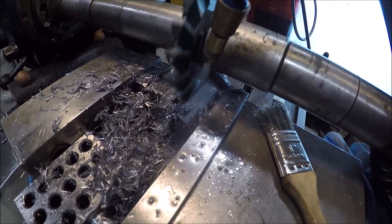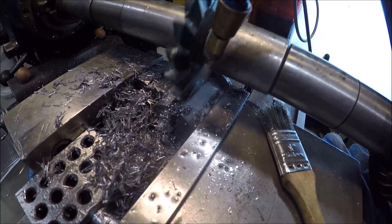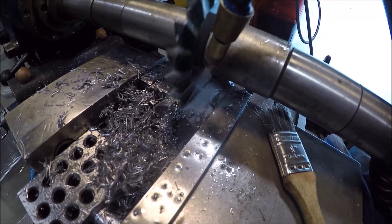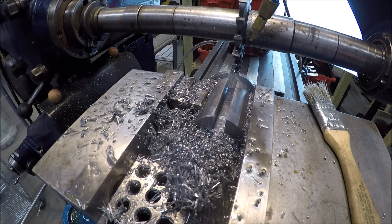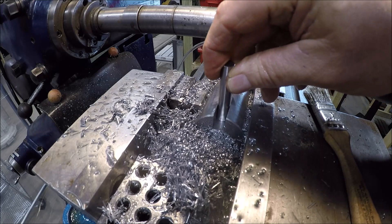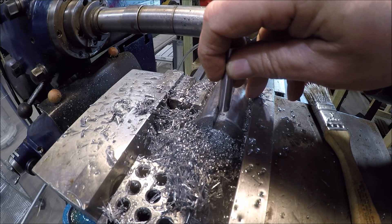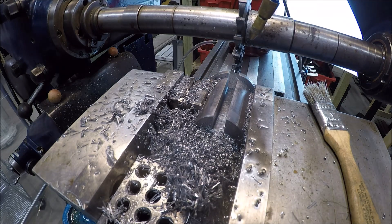So I've moved over 34 thou — cutting it just fine this way. Shooting for a width of 382 thou, so this is a 382 gauge pin. She fits good — a little bit of movement at the top, looks like the cutter cut it a little bigger up there, but as you go down she's solid. So that works — we've got room for a broach now. Let me get it out and get it deburred.